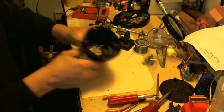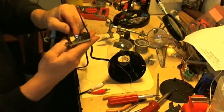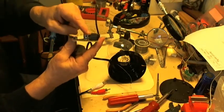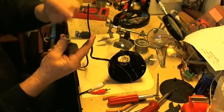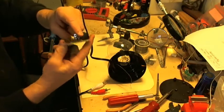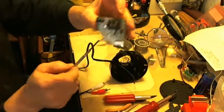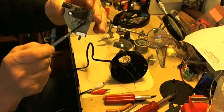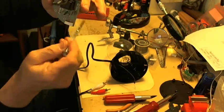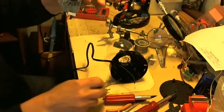Okay, so come over here. The primary hot transistor that actually turns this transformer on and off to fire the high voltage to trigger the plasma inside the plasma ball has a transistor coming off the base. It's this one right here. Okay, it's this one right there, the one closest to the back end of that first transistor. That first transistor is the one closest to this edge, the edge with the switch on it, and so forth.